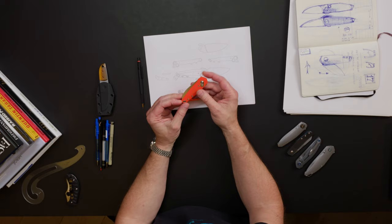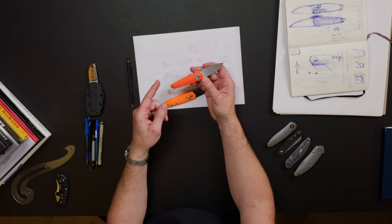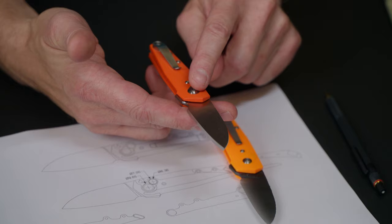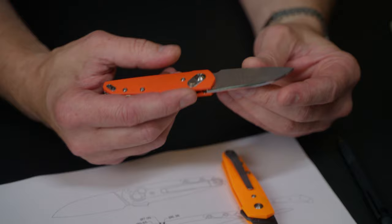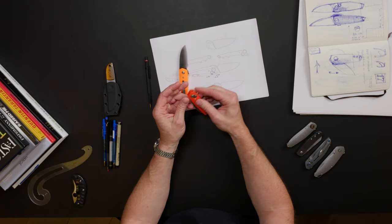So now we've actually moved past the 3D print and into actual materials. I would call it a mock-up of the actual knife — we're starting to work with the actual materials. This is a G10 handle that we milled out, it's a titanium chassis, it has the right screws, it has the right back spacers. I changed the clip now to a much better size, and now you can actually start seeing all the details and start making choices on texture in the titanium.